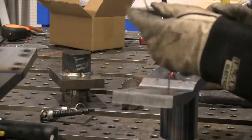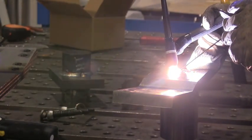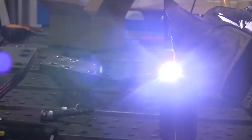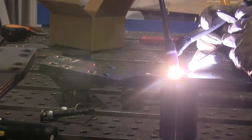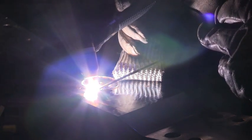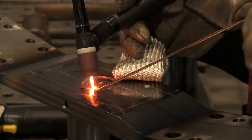I'm tapering off the amperage really slowly and keeping an eye on it. I'm using regular old mild steel ER70 filler metal on this, even though it's a high strength steel. The weld metal wasn't specified on the drawing, and I'll oftentimes use under-matched filler metal when given the chance, because the strength of this part really is in the design, not in the welds.